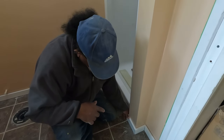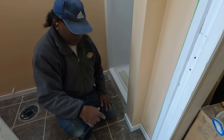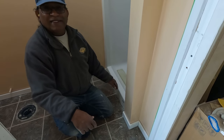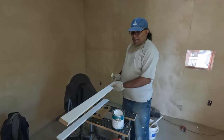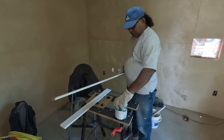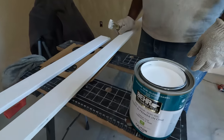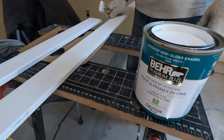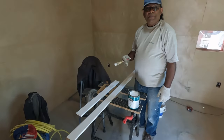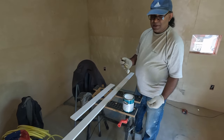The next step is I need to paint these before putting in the nails, then all the trimming is done. First I'm painting the baseboard with interior semi-gloss paint — it's easier to install after that because it's difficult to paint once it's on the wall. I'll be doing two coats of white paint, then I'll show you how to install with the nail gun.